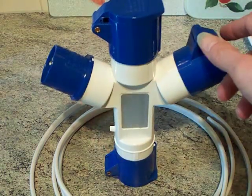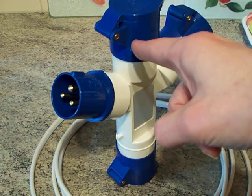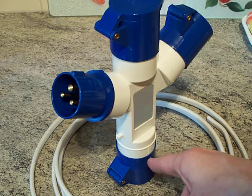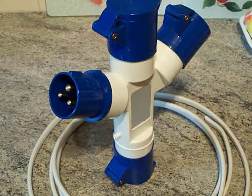What I'm going to do is have the power coming in from the plug, because I've customized it. All three conductors are going to come from the plug up to the first socket, out of there into the next one, and then from there all the way down. If I've got enough cable left, I want to bring all three conductors back up to the plug again — like a little ring circuit inside, so for each conductor there will be an effective cross-sectional area of 5mm².